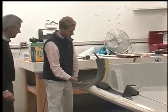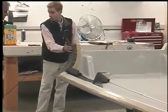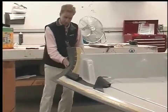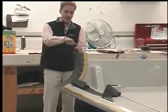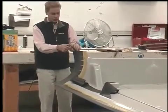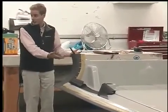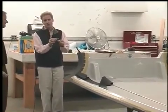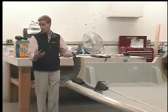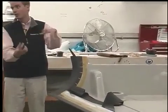Then in addition to that, we come back here to the transom. And you can see there's a large surface for the tube to attach here, and you can see it's already kind of shaped to take the tube. So the tube gets set in here and then we attach it over again with some additional patches here and some other patches. There's a series of probably 20 patches that hold the tube onto the boat, so it's not just a single point — it's a multiple set of attachment points all kind of working in opposite directions to hold it on.